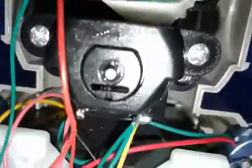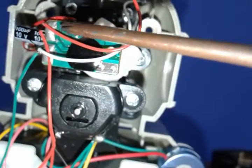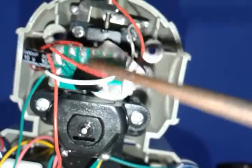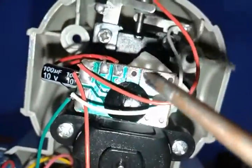When you guys open this robot, you're going to find out that the sound chip has — for all those who know, it's going to be super easy, but for all those who don't, be careful. Here are the speaker contacts, and here the positive and the negative contacts for the battery. Here are three contacts — these are the ones I'm going to use for the transistor in case he has blue hands, which I'm going to show later in the second video. Basically, if the robot has red hands, it's not going to be necessary to put a transistor.